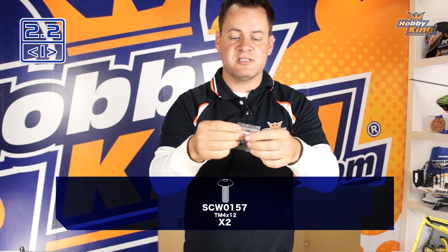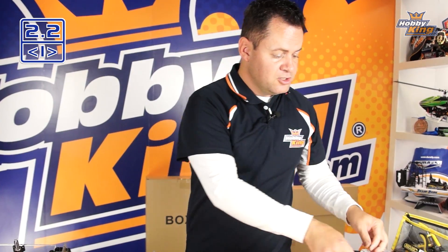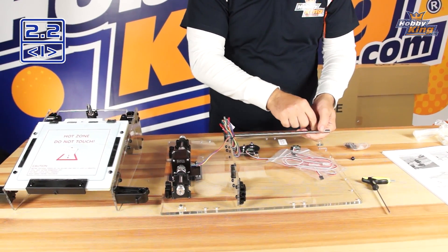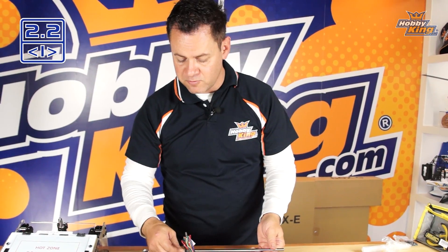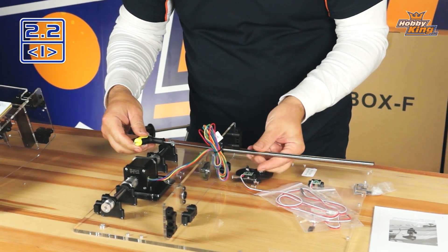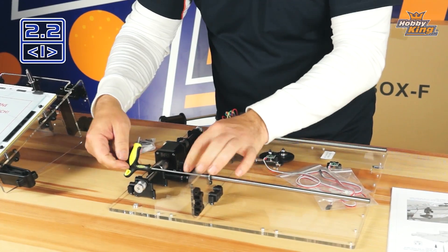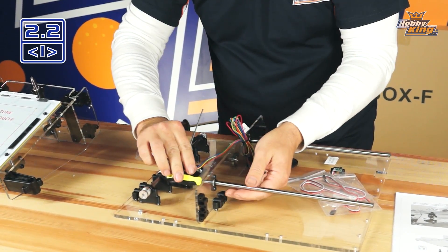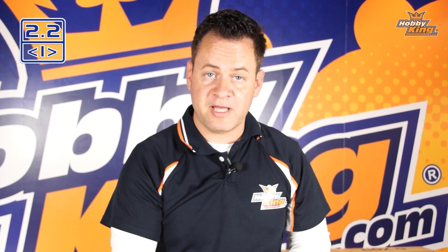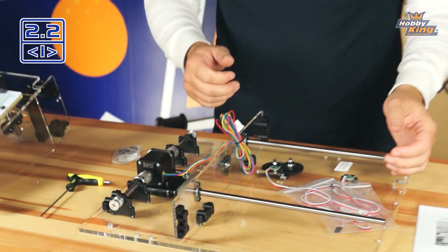The hardware we need are the 157s — it's a slightly larger screw with a machine fine thread, distinguishing it from the others. We're going to need two of those and the M2.5 hex wrench. First, insert the rod from the bottom coming up toward the top, supporting it so the weight isn't flexing down, then install the screw and run it down with your hex driver. These don't need to be extremely tight — just snug against the molded plastic inserts so they won't come loose.